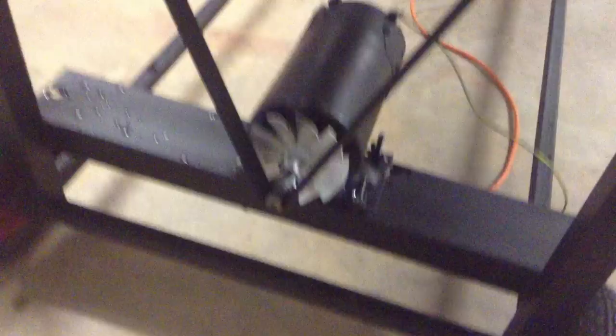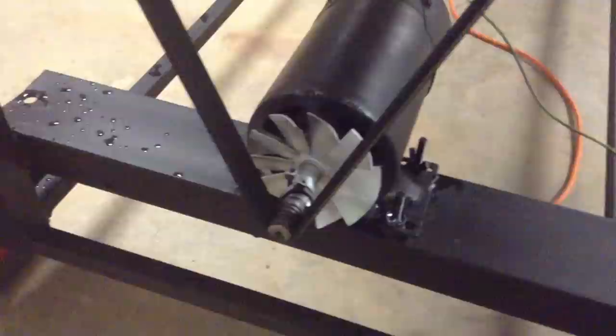And this is the motor from the treadmill — obviously painted it up and made it look a little bit nicer. And that's the shaft I modified. He had a 50 mil pulley on it but it was spinning too quick, so I basically took the pulley off and used the shaft, and put some grooves in it to suit the fan belt.